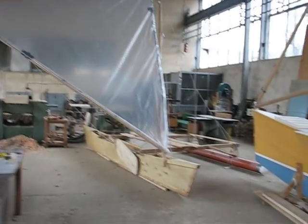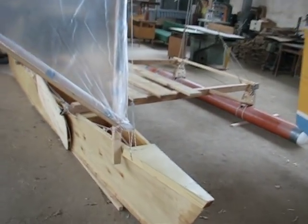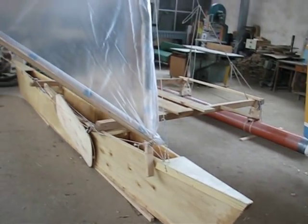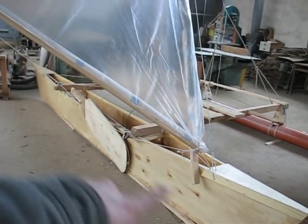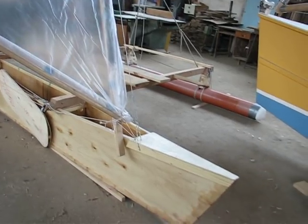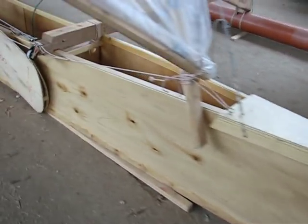So this is how you build this boat. The vaka is stitch and glue — one liter of epoxy did the whole vaka. Everything else I did only the stitch and glue with epoxy. Everything else that's glued on has been glued on with PU, polyurethane waterproof glue. Everything is just PU.